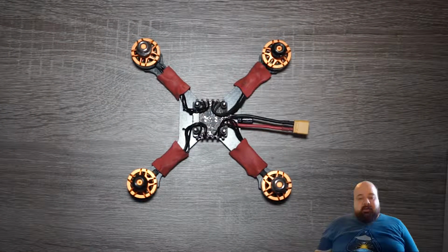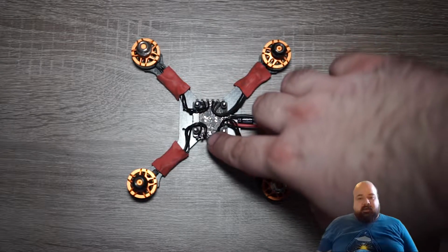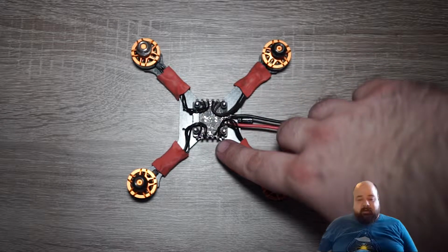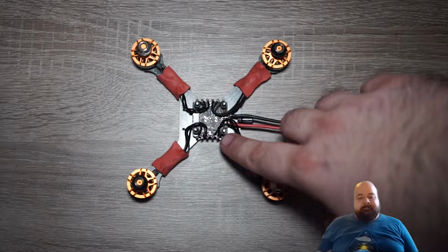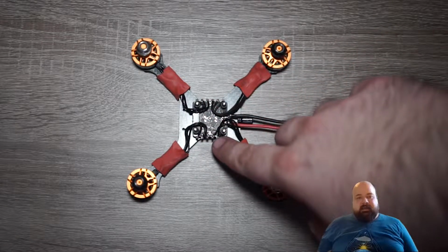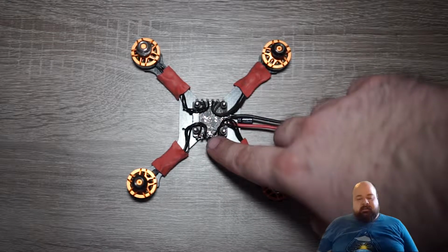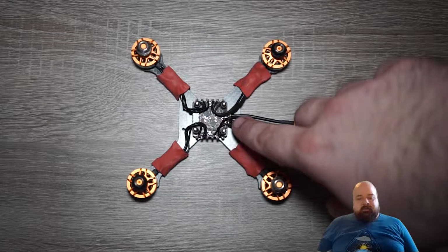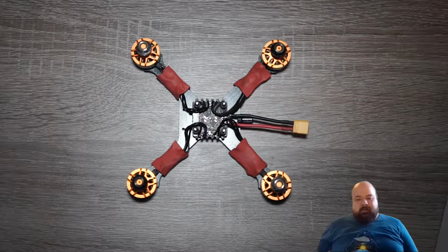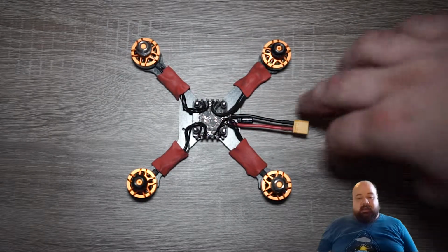The next part is me then soldering the motors to the ESC, and I didn't record that as I needed the space to do the actual soldering. And every tutorial I looked at said that the order in which the cables are doesn't matter, so you can solder the 3 cables of each motor in any order, 1 2 3, 3 1 2, that you want to the ESC.